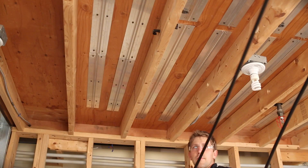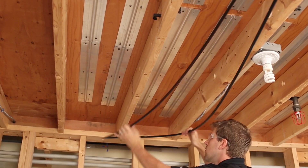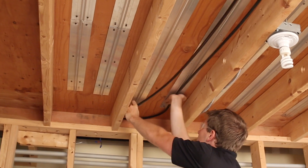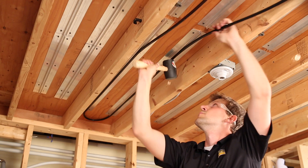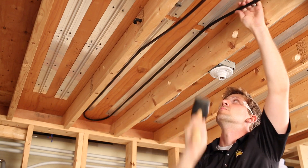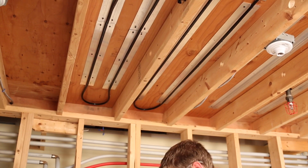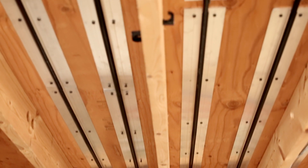With a coil at the opposite end of the room from the manifold, pull tubing through the joists and attach securely to the manifold and route up to the first joist bay. Pull the tubing through all the joist bays as you cross over and create a loop in each subsequent bay, snapping tubing into the ClimateTrack. Be sure to keep tubing unrestricted when making loops and turns and to deburr the track at any edges.